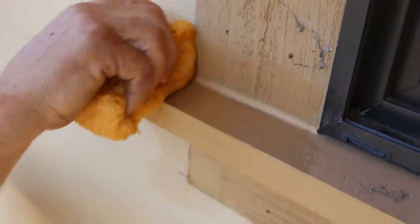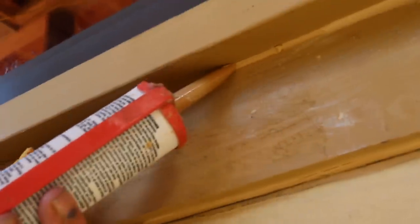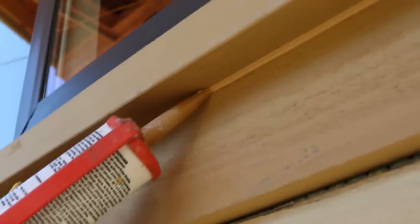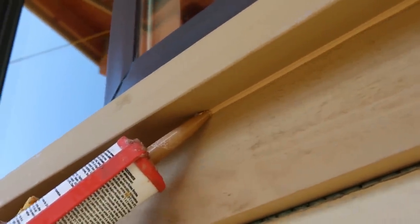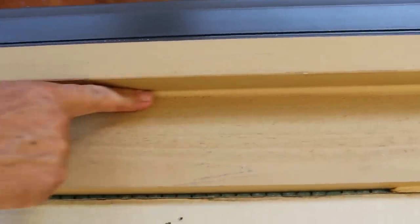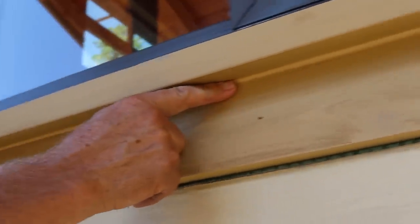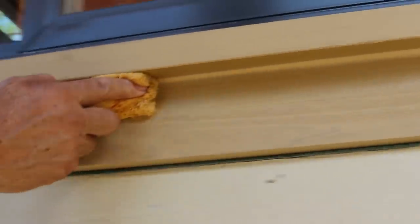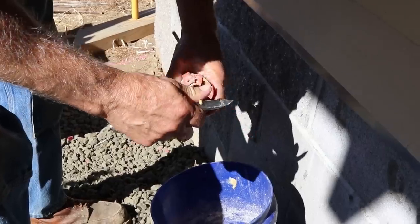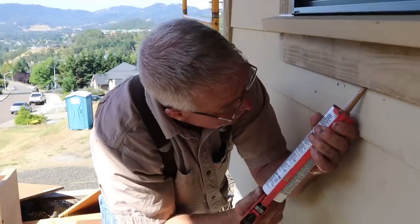And don't underestimate the importance of selecting the right brand of caulking. Talk to painters. Talk to somebody at a pro desk. See what's popular in your area and don't be tempted to try and save money on this. Spend the money on the nicer caulking to ensure that it will last a long, long time and not just be an ongoing maintenance item for you or someone else.